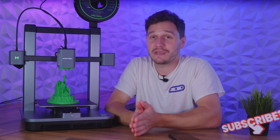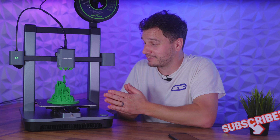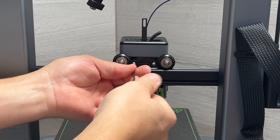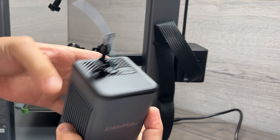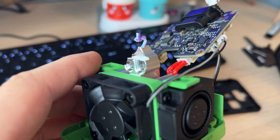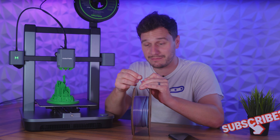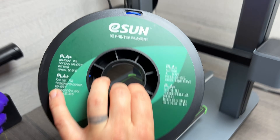I'm a big believer in balance, and so far I've been pretty excitable about the M5C, which I think is justified. But let's try and do a little bit of nitpicking. I did try to print some dual colour PLA on this thing and it did clog up, twice — to the point where I actually had to completely disassemble the hotend and physically drill the clog out. However, the filament I bought was on the cheaper side and it was extremely soft, and I've had no issues with my usual go-to ESUN PLA Plus since.